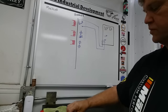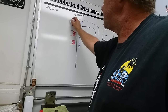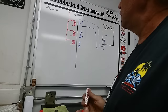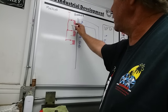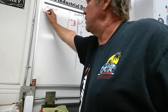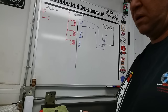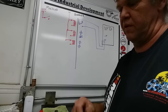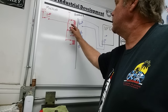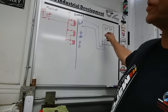Now let's control the coil. All we have to do is energize this coil to get a run command. Let's say we have a switch on the machine — all the coil neutrals are commoned up. We've got these coil terminals to power up off 110 volts. Maybe there's a rotary switch or a flip lever on the machine carriage for a forward command — we call this 'forward' — and all we do is bring that over to the coil. When the forward switch is activated, the coil energizes, the relay closes, and our VFD starts.